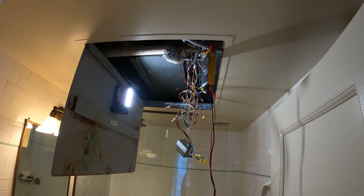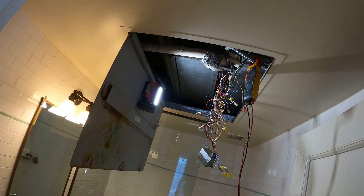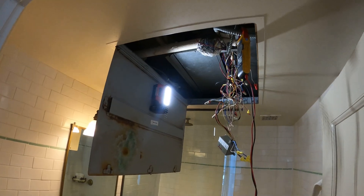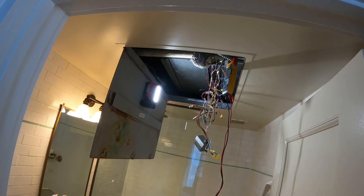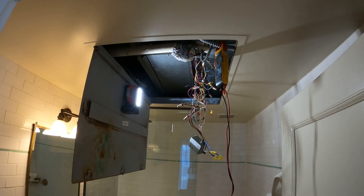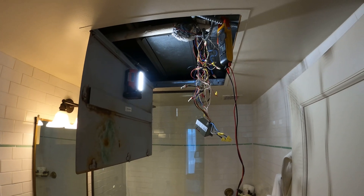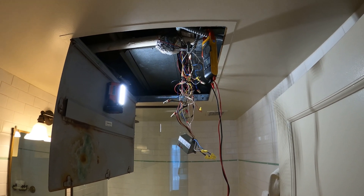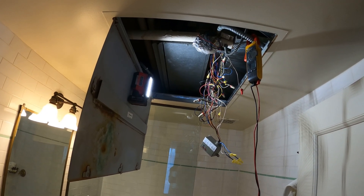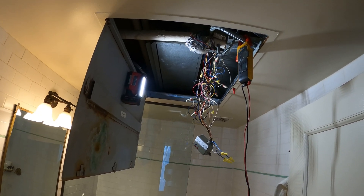We are now in October where one day might be warm so you want the cooling. But if they want heat, right now it's chilled water — they have a chiller downstairs, so now it's chilled water going through the pipes. In about a week or two they're going to switch over to heating, so that chilled water in the pipe is going to become hot water. So let's go ahead and see if we can get the emergency electric heat to come on.